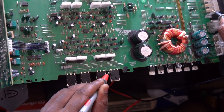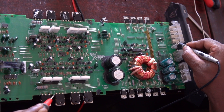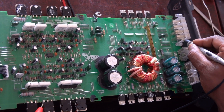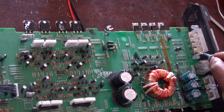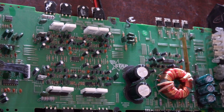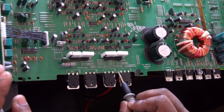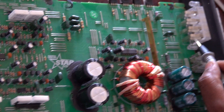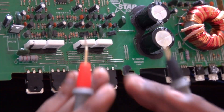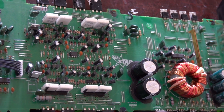This is the right channel - these two are connected to this one, and this other two are connected to the right channel. They have positive and negative pairs: the right positive is connected to two transistors, the right negative to the other two. The emitters of these transistor pairs are connected to the output that goes to the speaker. You can trace the channel to the transistors - if only one side of a channel is playing, it's most often the output transistors.